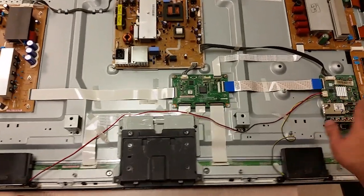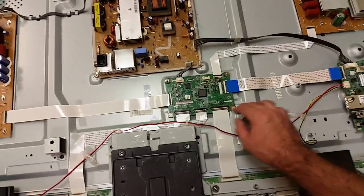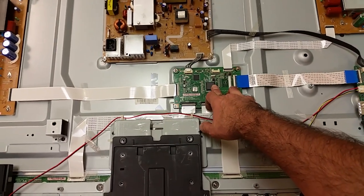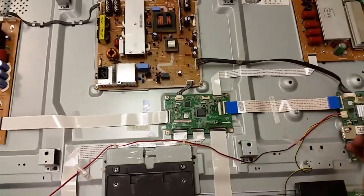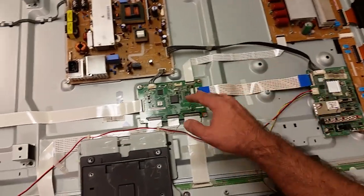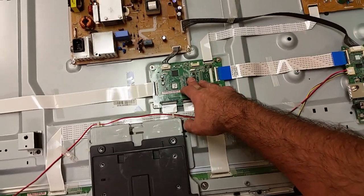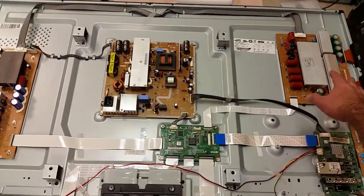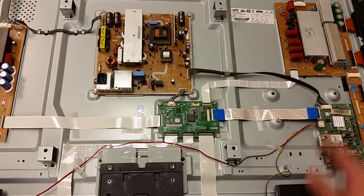And there's a way to test when the main board is bad. There's a jumper combination here, the 2 and 3, I believe, that can be shorted if this is detached. And then this small board, which is basically just responsible for orchestrating the two sustain boards so that they produce a picture. The picture is being passed by the main board, frame by frame, picture by picture, and all the individual bits are being taken by this, it's called plasma logic board, which just converts it to signals that make it possible so that that picture is being displayed, I'm sorry, on the plasma panel.